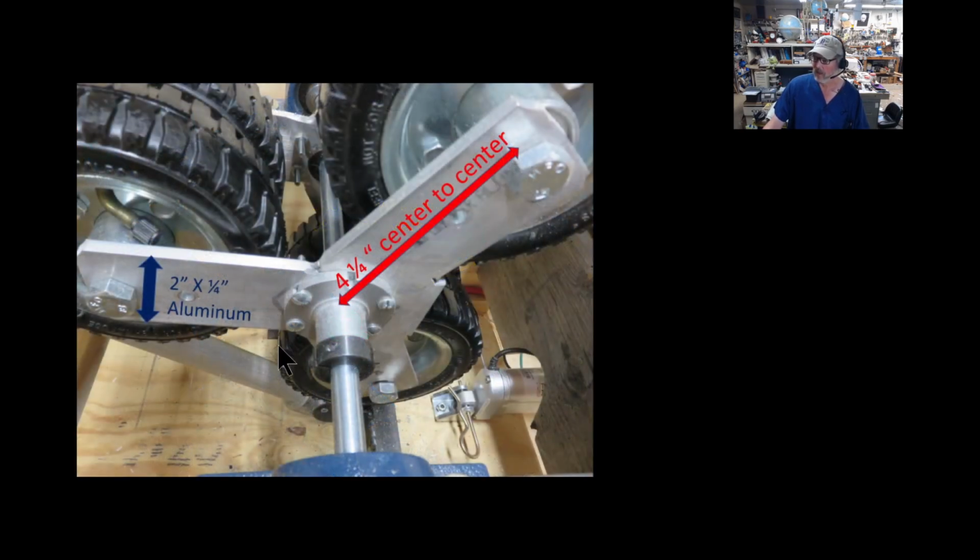In fact, I use this same type of hub to mount my aluminum wheel holder. And this aluminum wheel holder may be a sticking point if you're designing this and can't weld aluminum. It's the only piece I really used aluminum to weld up, but I'm pretty certain you probably could make this out of that Baltic birch plywood. You know, the stuff that's got uber layers, almost like veneer type of construction. If you had a couple pieces of 1/2 inch or 3 pieces of 1/4 inch glued up with that Baltic birch plywood, I think that would be plenty strong. That stuff is very strong.